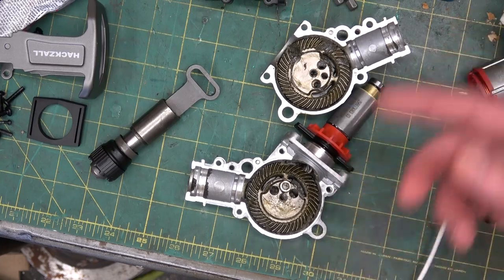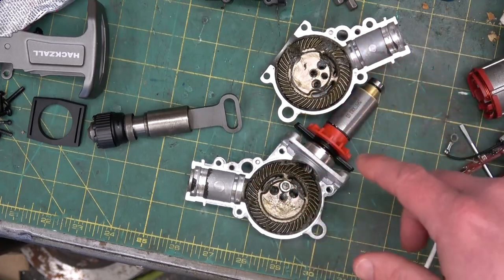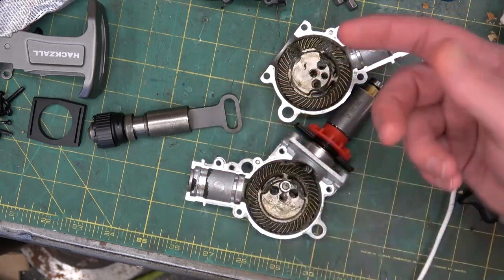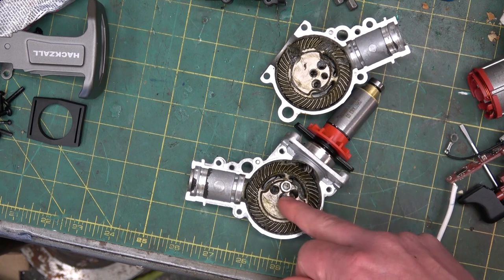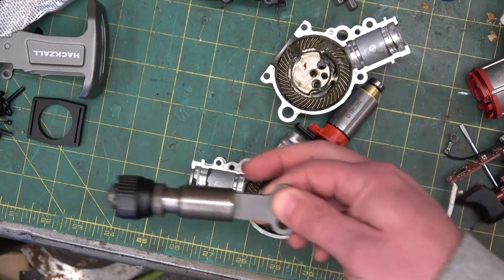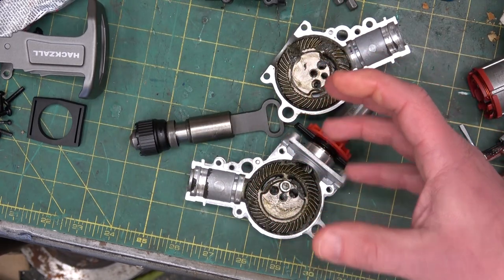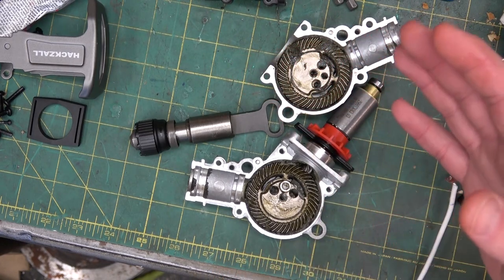What we have is reciprocating motion being converted into rotary motion. This is the obverse of that — rotary motion being converted into reciprocating motion — but we can infer some similarities. What's going on here is we are using the counterweight of this crown gear to reduce the effective harmonic of this thing choo-chining to and fro. Now in an infernal combustion engine, we have a number of mechanisms to ultimately reduce harmonic impulses.